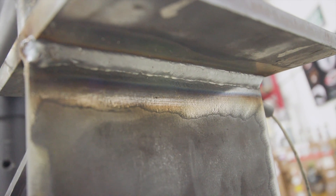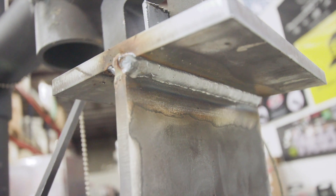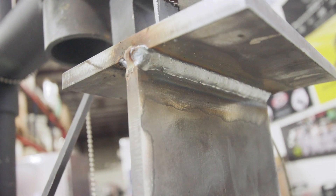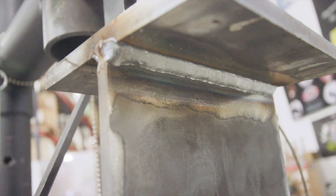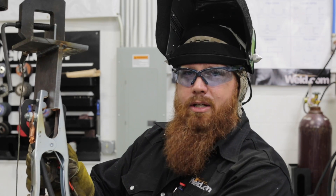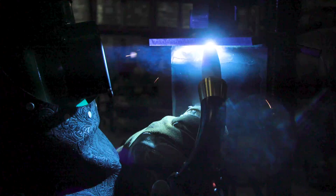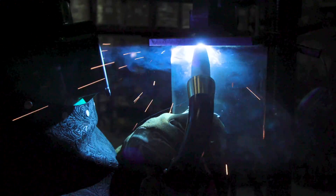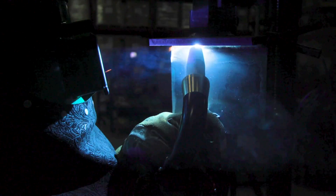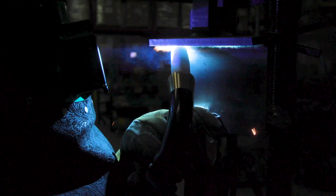Overall, that turned out pretty decent. I'm going to run a second and third pass to show you how to do multi-pass and stack those passes. There were questions on whether you should weld top to bottom or bottom to top — we're going to get into that. You'll notice I've got the baby shark clamp here for stability. I don't want to prop up against the plate because it's going to start getting hot. I'm getting myself into a groove, keeping stable, and working across the joint so everything stays uniform — especially important for production work or aesthetically demanding welds.